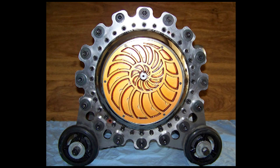Today I'd like to explain in a little more detail what exactly is happening inside the Fibonacci rotary vane engine. As you can see in the photo of the engine, you'll note the very center point actually is slightly above the center point of what would be the outside housing. That's what we call an offset rotor. And the offset rotor to the housing allows for a shape inside the engine which gives us what some would call, even though it's not a proper term, vapor hydraulics. I'll explain more about that later.